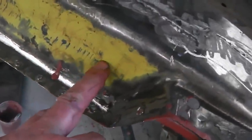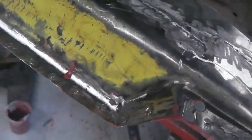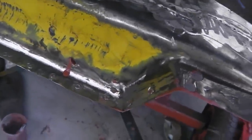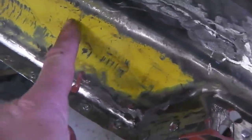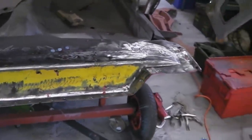What we're going to do, we've got a nice little trick. We're just going to keep the original spot welds here. Can you see them imprints? Because when I removed the old leg off this one, I ground it from the back, leaving imprints there. Well, I'm not going to drill through those. I'm going to drill new plug weld holes here, which will get ground flat. These will be left, so it'll look like factory welds. It's a little trick which will improve the look in the boot.